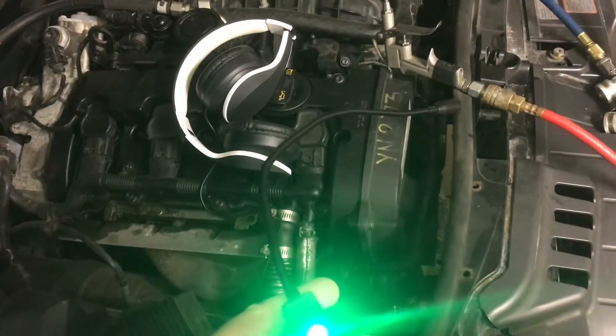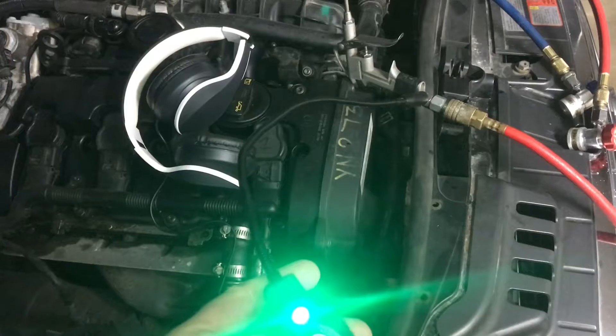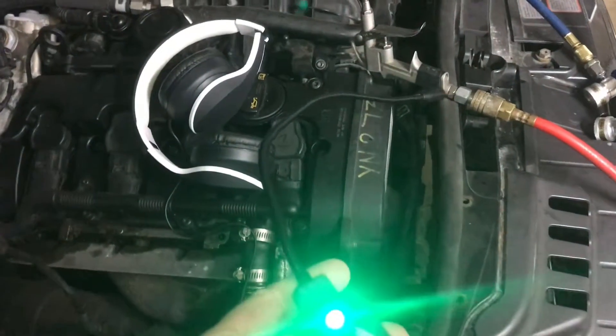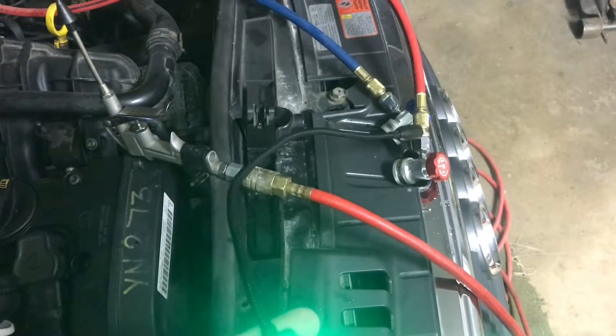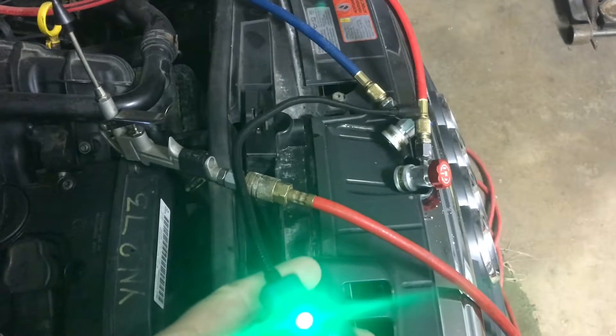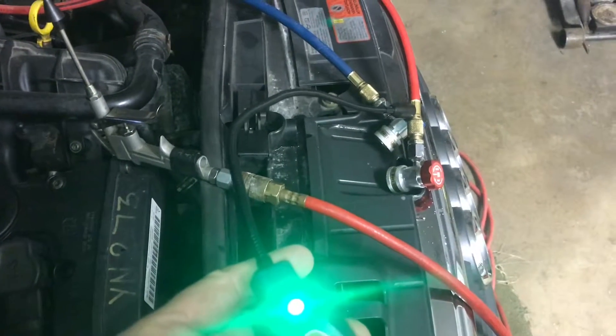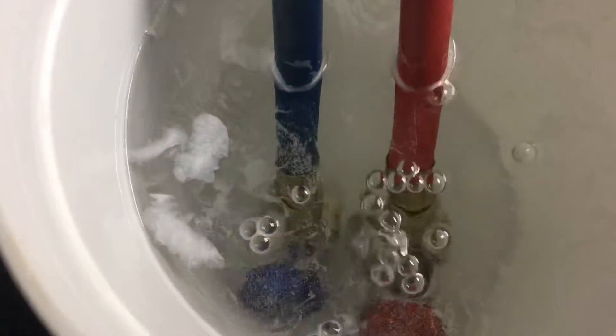Now when you come upon a leak, these clicking sounds inside the earpiece are going to go up. And when they go up enough, there's a red light that's going to say 'leak.' I know for sure that I've got a leak right here on my air conditioning gauge — it's a much smaller leak, and I've got about 60 psi on the gauges right now. To show you where the leak is, I'll throw it in some soapy water. Now you can see it as plain as day.